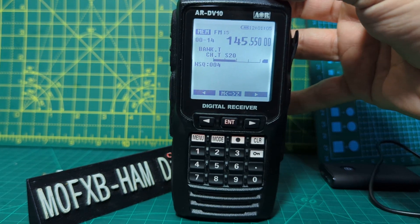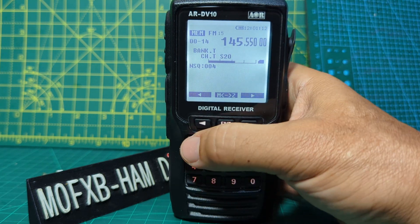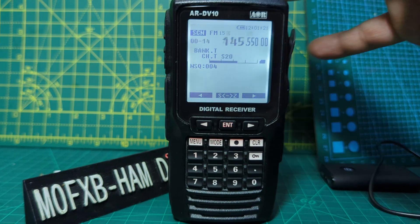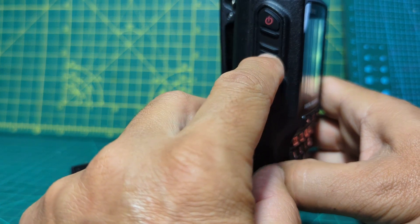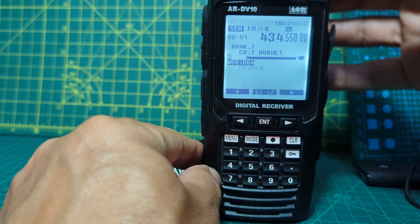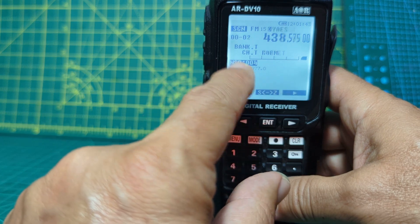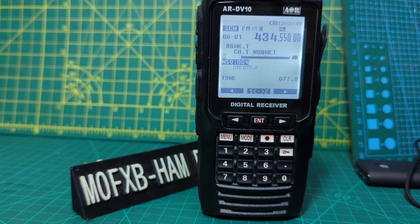Just go menu to the right, enter — there are my memory channels. Turn the large knob to scroll through after pressing enter. It's not actually changing my memory channels now, so maybe I'm on the wrong bank — oh, there it goes. To scan, press menu to the right, enter, and it actually scans — press enter twice. You can help it along by turning the knob. That's your volume. For squelch, press the button here — this gets highlighted. Press it again and it's unhighlighted; press it and turn the lower knob for squelch adjustment. If you see LSQ it means you're in AM, LSB, USB, or CW. NSQ is your FM squelch. Thanks for watching my videos on the AOR DV10 — 73, all the best.